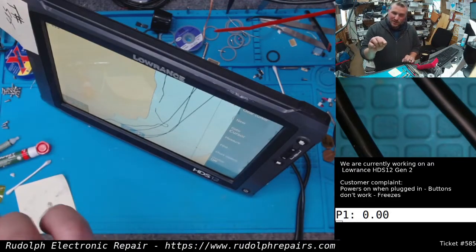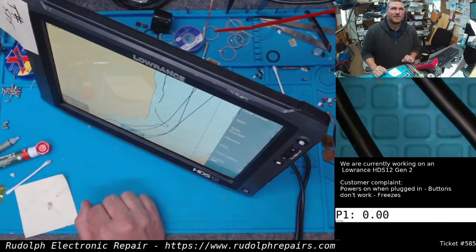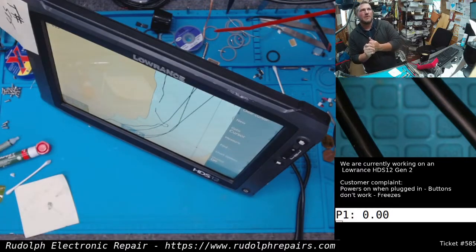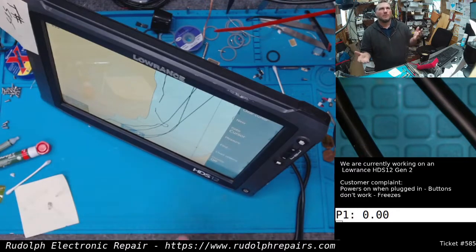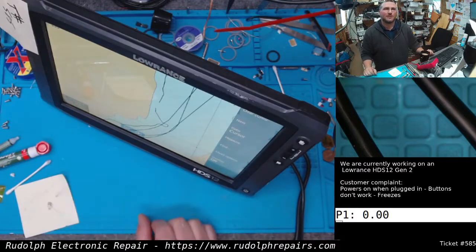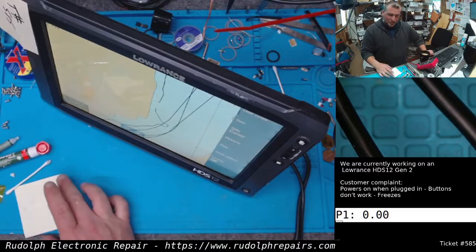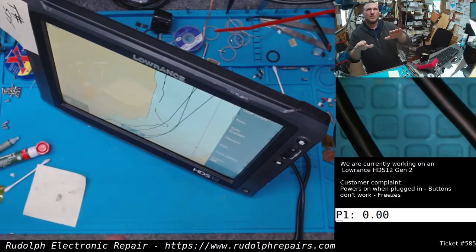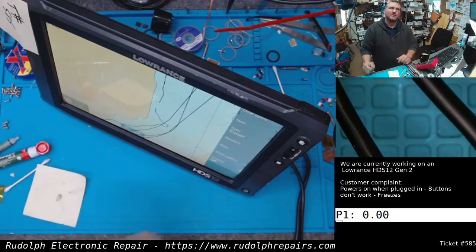I rebuilt the contacts on the digitizer, right? And then, okay, now I have conductive pads in the digitizer. Well, how am I going to connect the cable to the digitizer? Adhesive isn't going to work because it's going to be an insulator, right? So what do? I tried sandwiching some of the paint stuff in there. It didn't work well because it squished out and I had to take it off, clean it back off again.